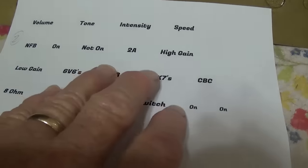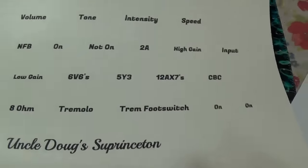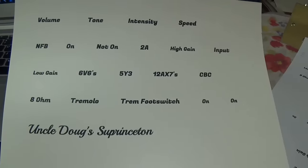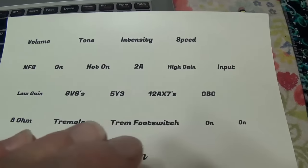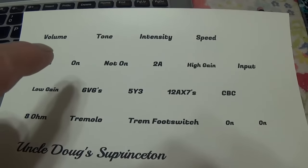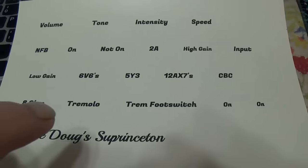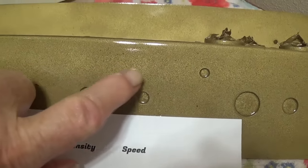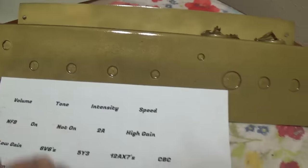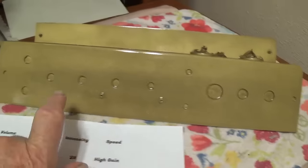After I came up with what I thought was an acceptable set of labels, the next step was to print it with my laser printer on the special decal paper. According to the directions, if you use a laser printer, you don't have to apply a fixative over the printing. But if you use an inkjet, you have to use a clear fixative to seal in and protect the ink. We're going to cut these out, soak them in water, and then hopefully they will slide off the paper and onto our chassis. When they dry, they will be firmly attached. After they've completely dried, I'll have to clear coat the chassis again to seal in and protect the decals.